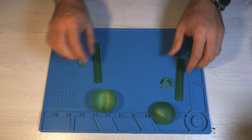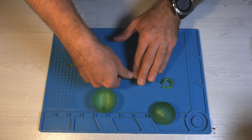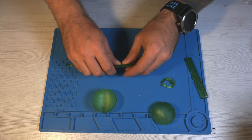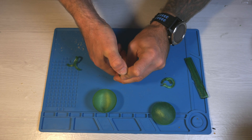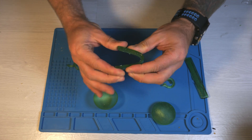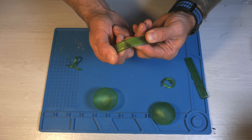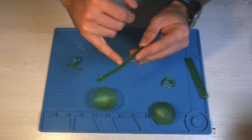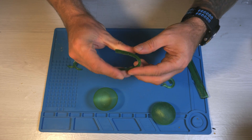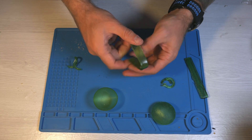Same for the plates — I can push with my finger but can't break the standard resin plate since it's too thick. Checking the maximum bend radius of the UV TUF resin, I can bend it quite far, but there's no way it will keep its structural integrity after that. I can see the deformation even after flexing it back. So you can bend it as shown in the pictures, but it's essentially a one-time action — bend it once and the part is gone.